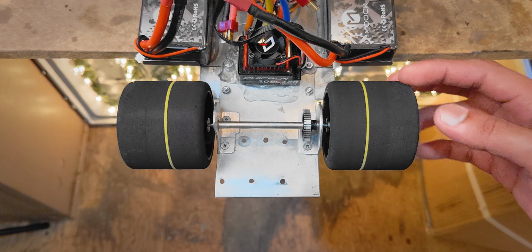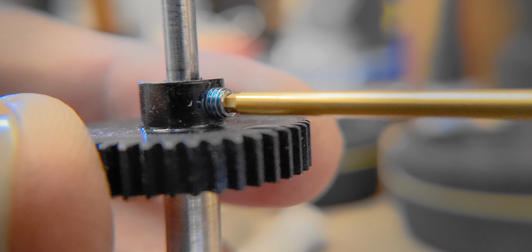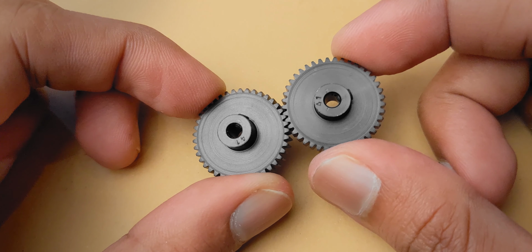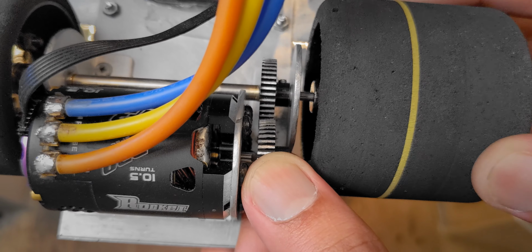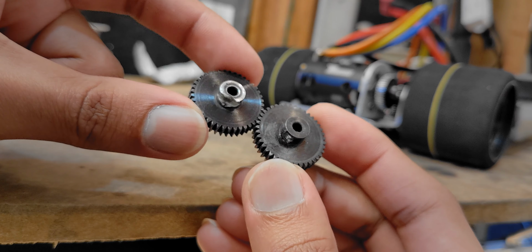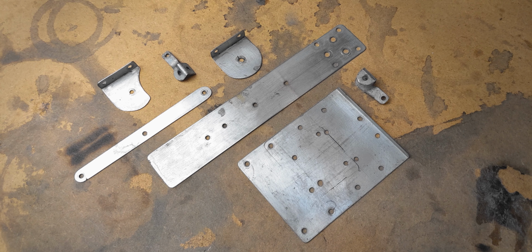But I think I could have done better with the motor I have if I spent more time making the parts more precise. Things were not perfectly centered, and these wobbles obviously limited the RPM, and vibrations from those actually caused things to come off during testing. So I ended up using thread locker basically everywhere. Also, using gears that have a high pitch was a bad idea because it's easy for them to not mesh the right way and they can end up rubbing off of each other. In the last test, the gears got completely worn out and they don't work anymore. These two are also the ones that are no longer usable, and these are the parts that had to be redone to make the whole thing work.